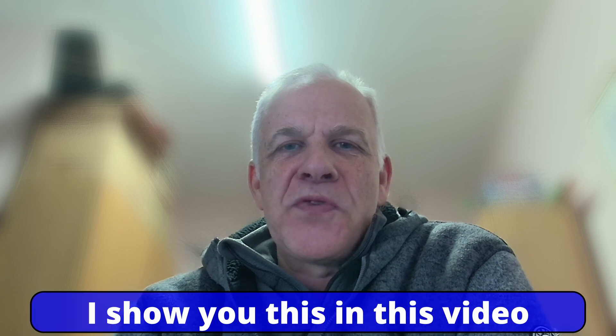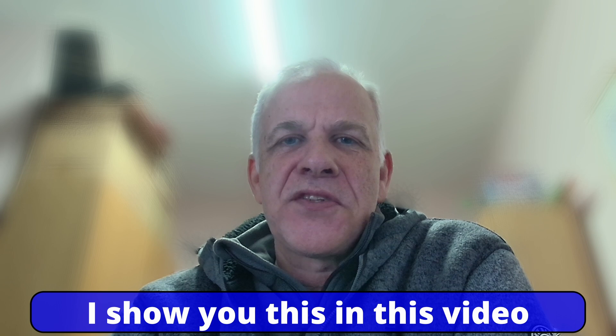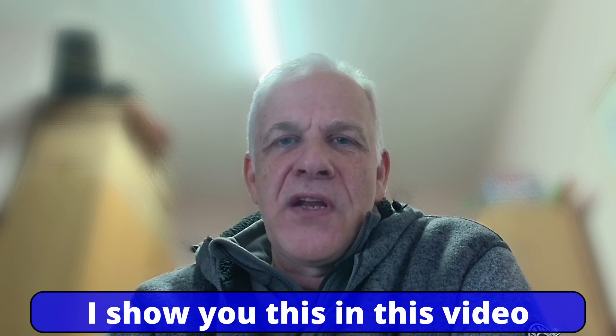Remember to check in the morning or before you start a session — just slowly move your carriage from side to side and check whether you've got any flat spots. If you have, just de-adjust your eccentric nuts, and you'll see in the video the importance of the little black mark. Anyway, that's me signing out for now — perhaps I'll see you at the end of the video.